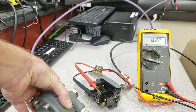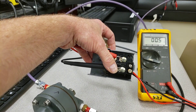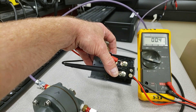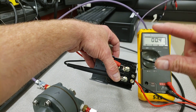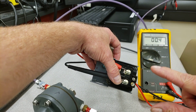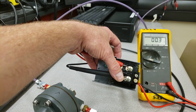You can see that with one switch it can be a pain in the butt — it's just two set screws, how hard could it be? But if I've moved the range too low, it'll completely confuse you and you'll have to bring the range up to adjust the values. If I move the range way too high, it'll never turn off. One set screw controls the whole range of values; the other only adjusts the top end of the range.